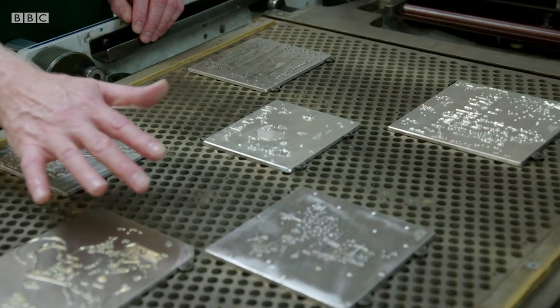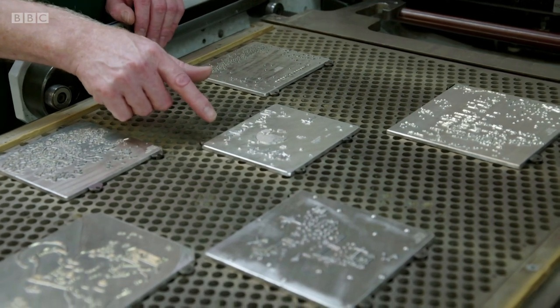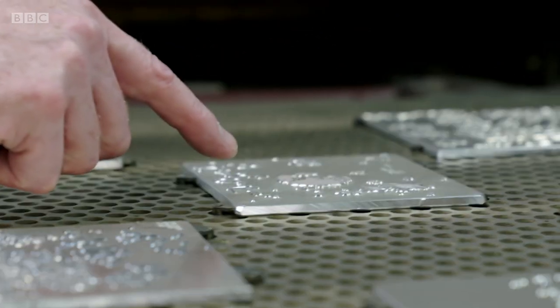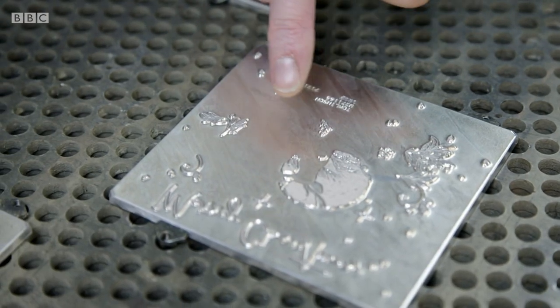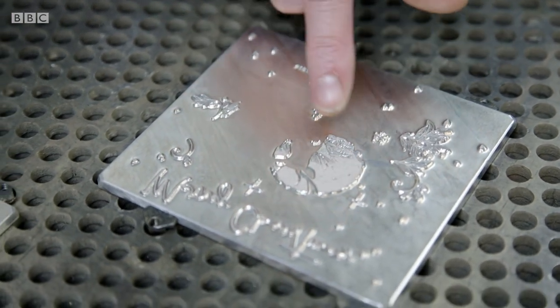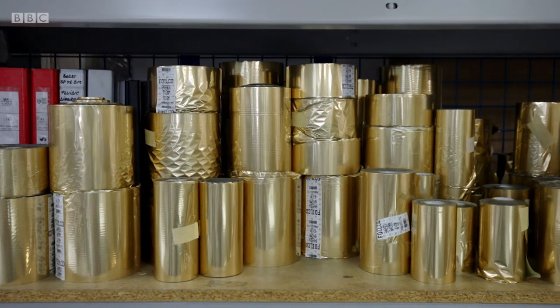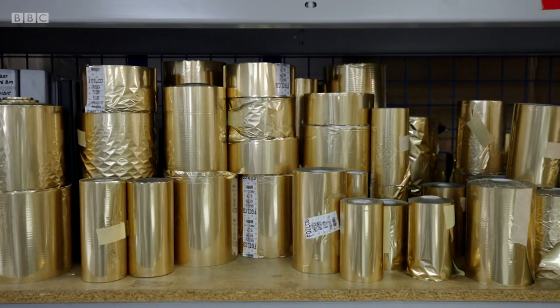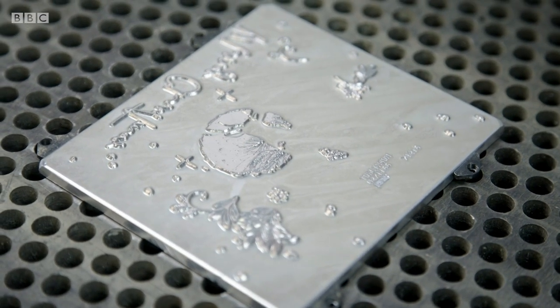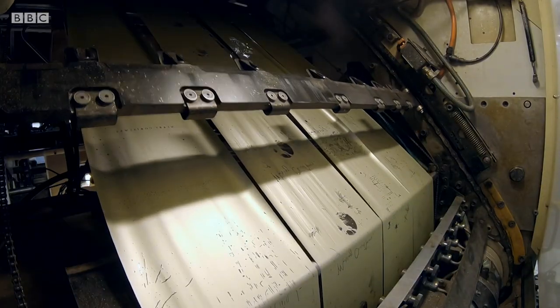What we've got in front of us here is a heated plate with six dies — this being the card we're following. The raised parts are the parts that will be printed in gold. Like a printing plate, this foiling die also has a raised surface. It's designed to apply shiny foil to specific areas of the card using a combination of heat and pressure. Inside the machine, the dies are now hot enough to melt the glue on the back of the foil and stick it to the card.